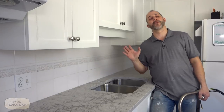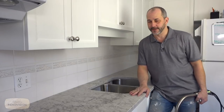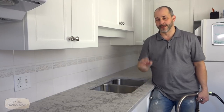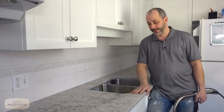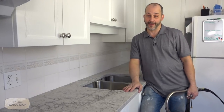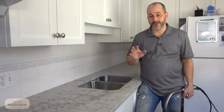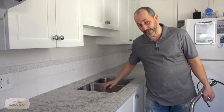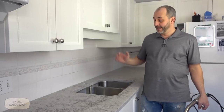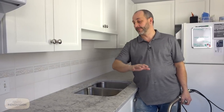The reason I'm covering stone countertops as a DIY video — which is kind of strange because you can't do your own countertop in this material — is because when you go to talk to your countertop company, there are a few things they're not going to do for you. Number one, they're not going to remove your old countertops without charging an arm and a leg. Number two, they're not going to disengage your old plumbing — most companies won't assume any liability dealing with plumbing. So you need to know how to disconnect, turn off the water supply, remove your faucet, and reinstate all the plumbing. If you don't know how to do it, then you're hiring three different professionals and this becomes a very expensive process.